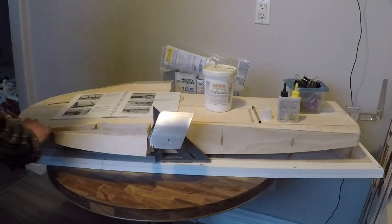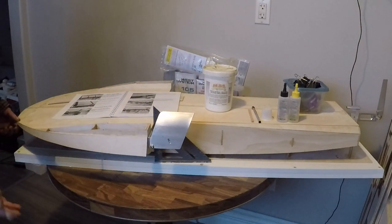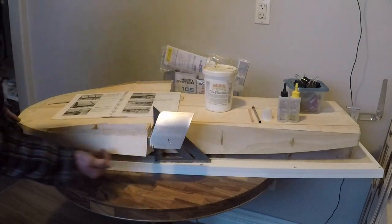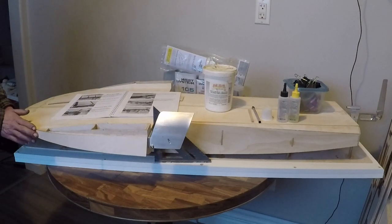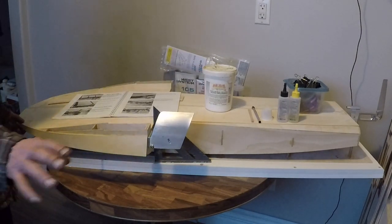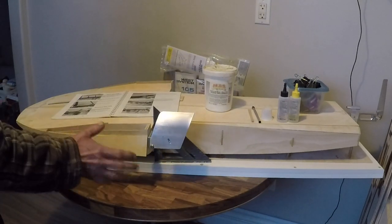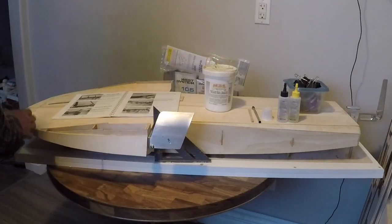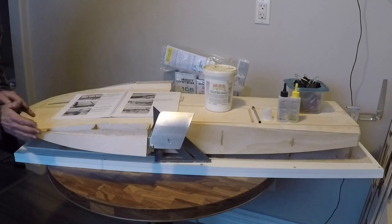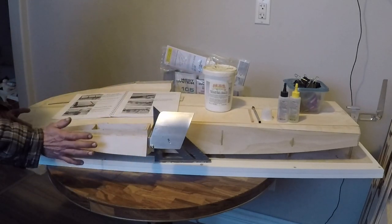At first I thought I had the laminate pulled off the wood, but when I took a close look, I didn't. When I looked at the amount of epoxy on the surface area where I had laid it, there wasn't very much there. Here's what I figured happened: when I laid my epoxy on the surface area, it actually absorbed into my wood and did not leave a lot of epoxy on the surface for the part to stick with.